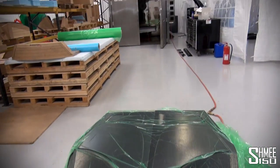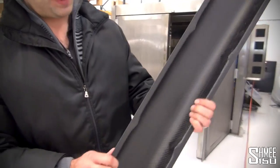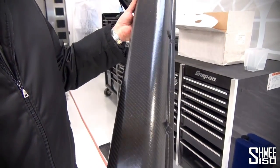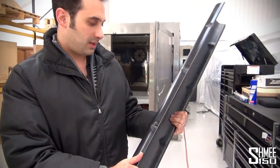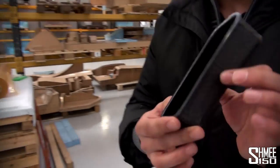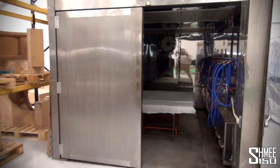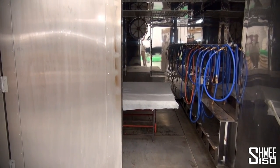You can see some of the parts that have just been made. That's the tunnel — weighs basically nothing. That would normally be made out of steel or lots of layers of plastic. It's doing two jobs — the force pipes run through here, and you can see scribe lines where the gear change sits on top. It's five times stronger than steel but half its weight per millimetre thickness. That's the door handle — you won't see any of that as it'll be covered in a flocking material. All these little bits save weight everywhere. In the oven we're doing everything non-structural, which is a large portion of the car.